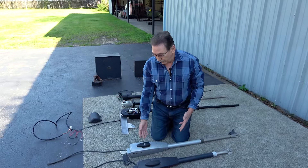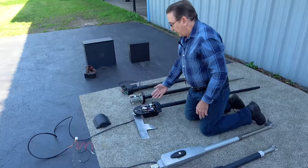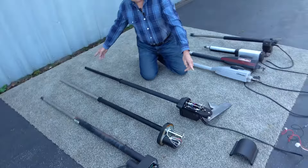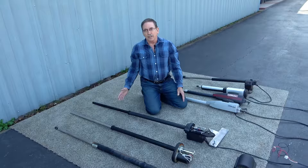I don't sell these at all and I don't recommend that you buy one. Not only are they not as good, some of the companies are charging hundreds more — LiftMaster for example, I've seen prices all the way up to twenty-five hundred dollars — and in my honest opinion they're just not built that well. What I've been using for decades is long arm openers. From the pivot point over to the hinge post, we're grabbing a full 13 inches out, whereas on the short one you're only grabbing four or five inches. These long arm openers are substantially better for holding your gate shut, especially if a child or dog is pushing on the end of the gate.